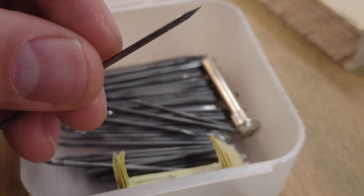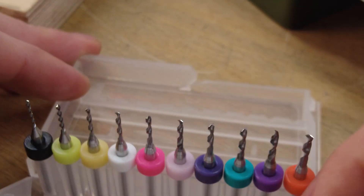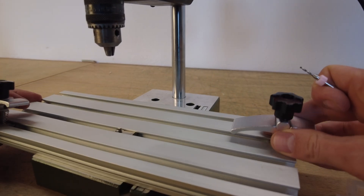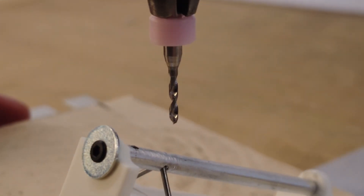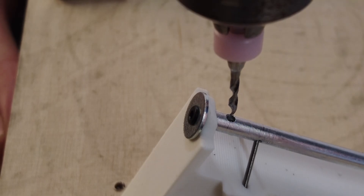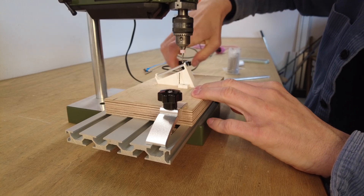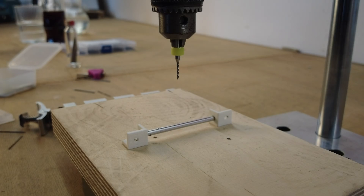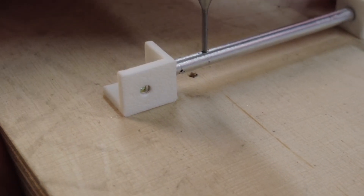As a stylus I want to use 1.6 mm tungsten rods. I noticed that I needed to make the hole larger, so I ordered a set of precision drill bits for this purpose. The result with the new drill bits was perfect — the tungsten rod fits just right. I also had to enlarge the two holes on the side of the tube. For the linkages of the driver caps I used 1.2 mm wires. This needs to be done for both holes.